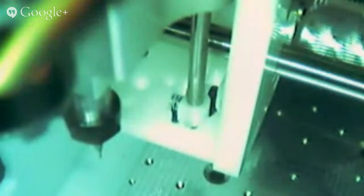Do you have a jump layer underneath if you're going to cut all the way through something? Yeah, the machine bed is what we call a sacrificial layer. So, you can gouge it, you can Dremel it down, you can remove it. You can also replace it, and we brought you a replacement bed. You just take the screws off, you pop it on. It's chamfered, so it's nothing.